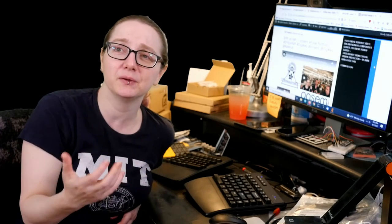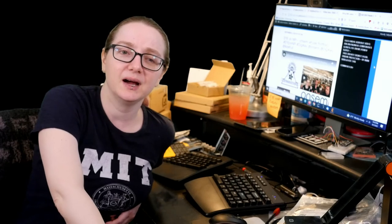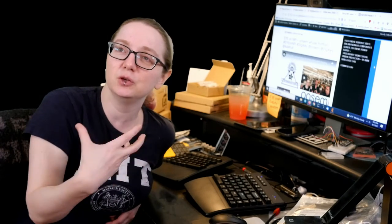On one hand, it's the easiest problem and also the hardest problem, because alkaline battery voltage can range quite a bit. Especially with four batteries, it can go above 5 volts or below. The right thing to use is a buck-boost converter. We already have a buck-boost they could probably use, but it's not cheap, $15 to $20 for a good one. Also, they're more delicate, you can break them.